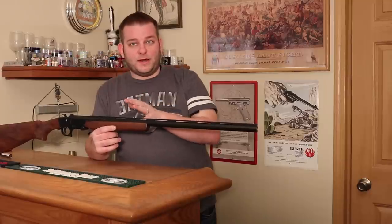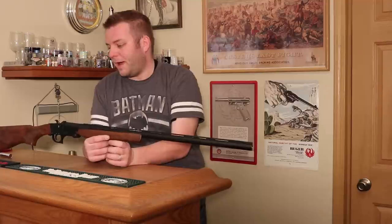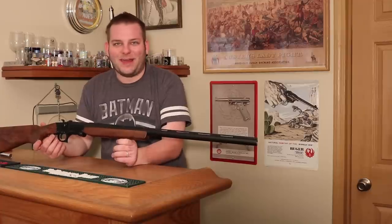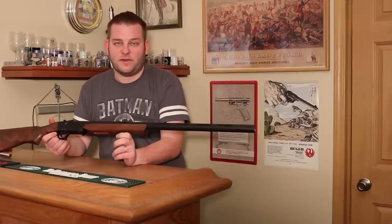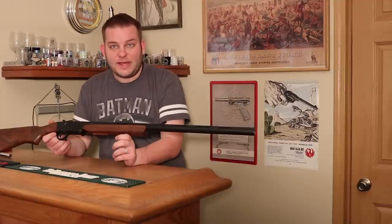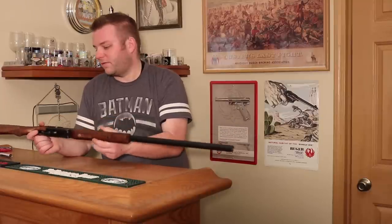What I'm going to go over today is what I think you want to do on a new gun — both to address the issues with the trigger that I hear a lot of complaints about, and to fix other problems. For example, mine when I opened the box had a stock that was loose and rattling on the action. The trigger is one of the big complaints — it's very stiff. When I was in there addressing the stock issue I looked at the trigger mechanism, and there's a pretty easy way to drop the trigger pull weight, essentially for free.